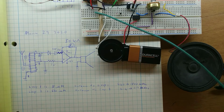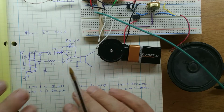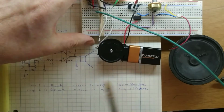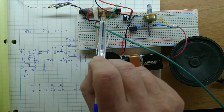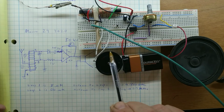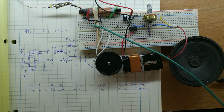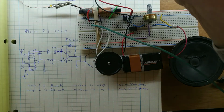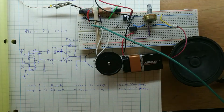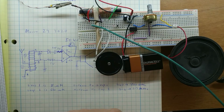Okay, class, this is our first home experiment. We're going to make a radio. This will be part 2 of it. The first part of the radio you'll have already made. It'll be this loop detector, this loop antennae, and this little diode, and this variable capacitor, and they're all hooked up. You should have been able to use one of these little earpieces as the output, just exactly like on page 127 of MIMS.